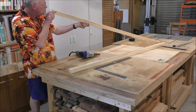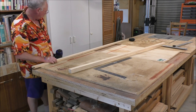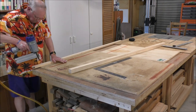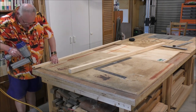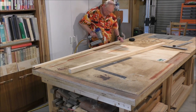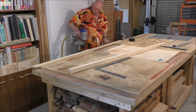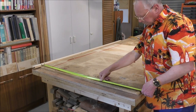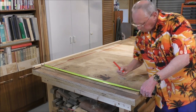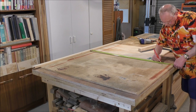So what I'm doing here is I'm putting a jig together, because the gate and paneling, or fence paneling, is all relatively the same size. So I'm putting a jig together that's a meter square, and so all I have to do is cut the parts, lay them inside here, then I know it's perfectly square, and then just pin them and screw them all up together.